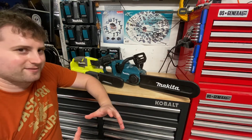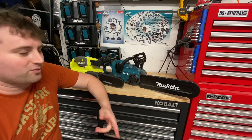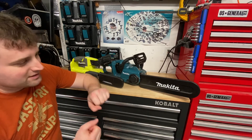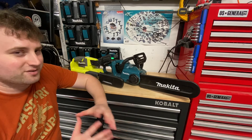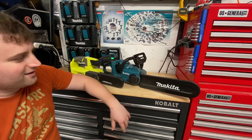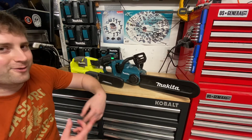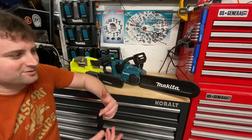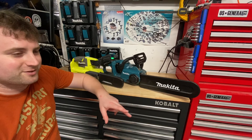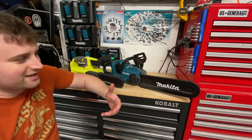The one big issue I've found with cordless chainsaws over gas chainsaws is they do overheat. I've seen this with Milwaukee, DeWalt, and my Makita does it all the time too, especially if you're in a hotter area. If you're really pushing that chainsaw, going through thick pieces of wood with almost zero breaks, you're going to overheat the batteries or the motor. You'll get maybe five to ten minutes of hard use before you get that overheat error. You can let it sit for a few minutes, or change out the batteries — I swap them when they lose one or two bars, around 57%, and that resets things with fresh, cool batteries.